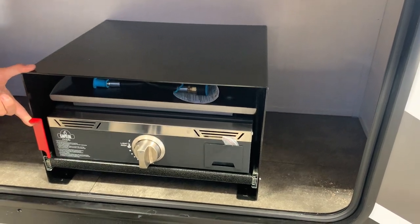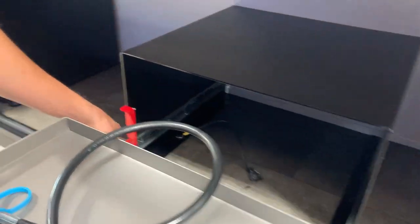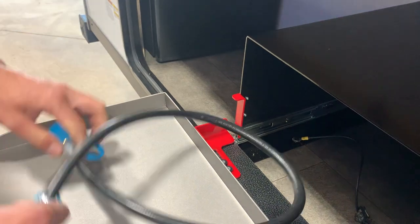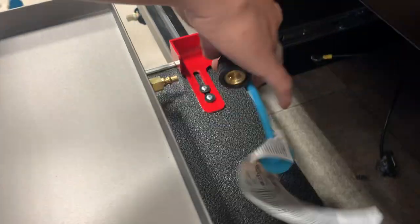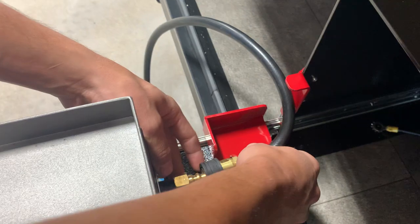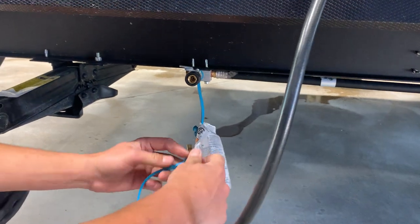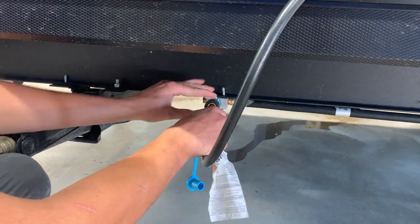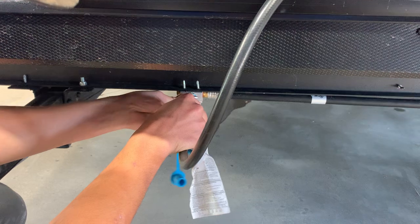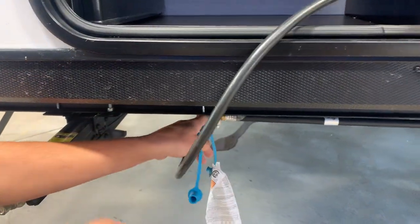You've got your little safety latch — popping that open will allow you to slide that out and lock it down. You've got another one right back here just for the propane connection. Sliding that over, you've got your propane hose — take the dust cap off of both ends. This one works like your standard airline fitting: pull that collar back, push it on, and it'll lock into place. This valve closed like it is now means the flow of propane is closed, so it'll allow you to operate the coupler. If you were to turn that on, it opens the flow of propane, and as an added safety measure you can't operate the coupler while it's open. So with it closed, push and lock it into place, then you can open up that flow of propane.